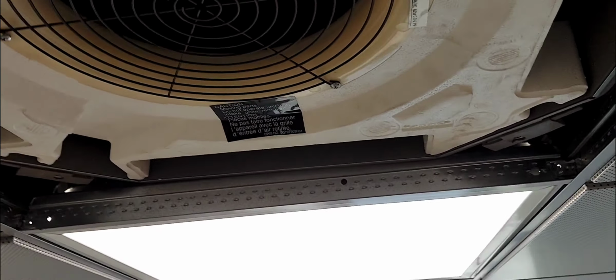Basically, you have four more Phillips screws. One, two. Actually, no, it's three. There's one back here. There's one right there, and two over here. So once you remove those, you can remove your pump assembly. But first you have to remove this hose clamp, which is rather rusty. Okay, you can take this hose off. That's where the water exits. The water enters the pump here. It siphons through this hole, and the water goes up and comes out the top.